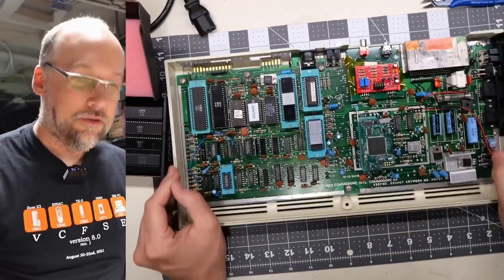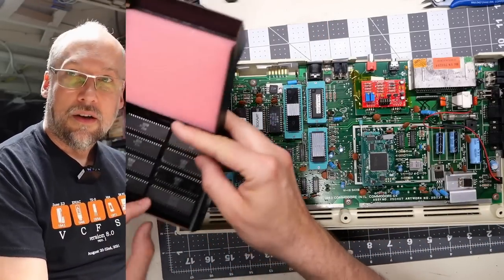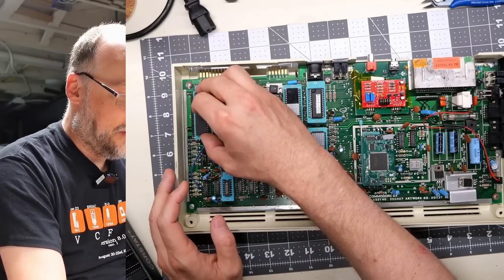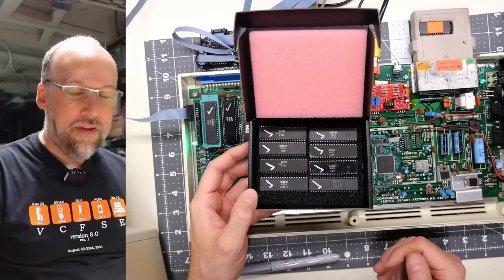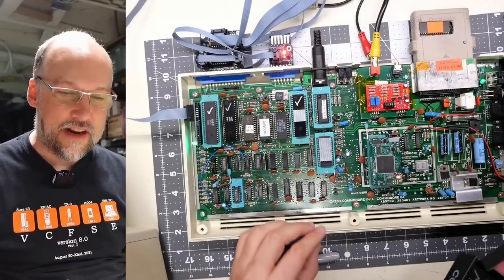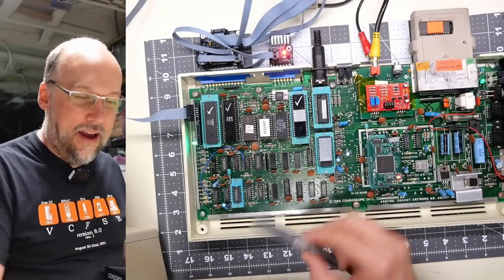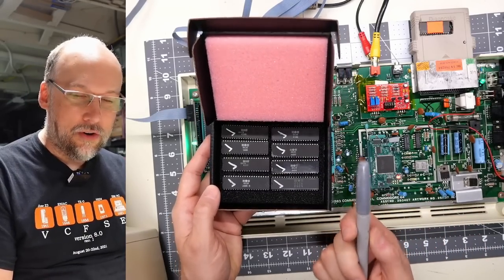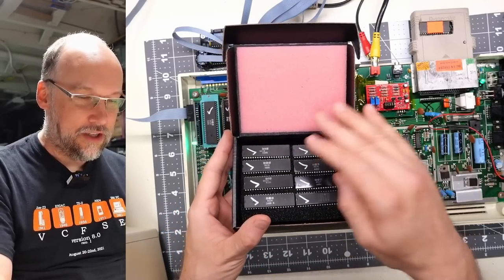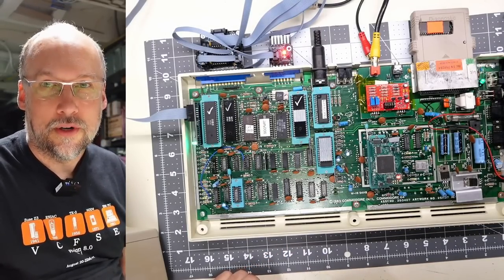So this is actually awesome, because this means I'll be able to truly fix some of these machines — not just fixed in the sense of 'it works now, put a label on the bad part.' Let's grab the ZIF64 — that's the 6526 tester — and pop these in. I'll quickly run through and test these, putting a tick mark on them when I know they're fully functional. Just like that, I've gone ahead and tested all of them. Brett, they're all working perfectly. The ZIF64 makes testing chips like this a cinch, with the test harness connected and the diagnostic cartridge. I have this nice Sharpie so I can write on them clearly.